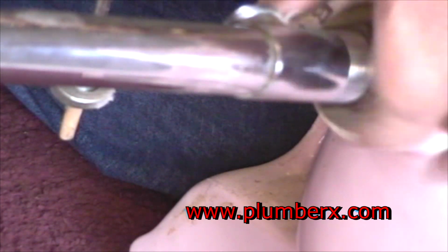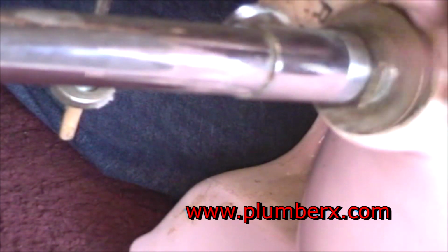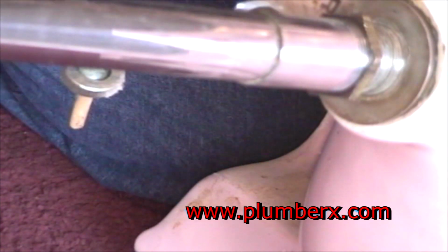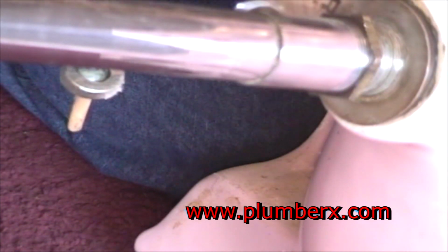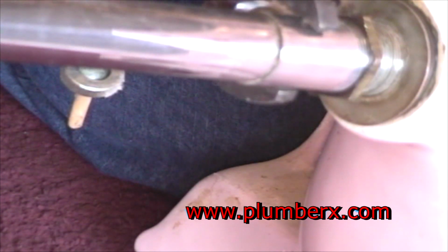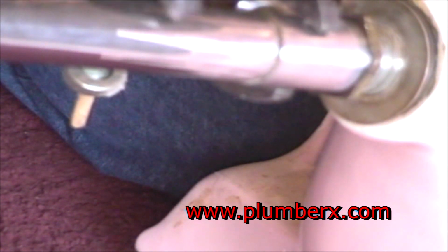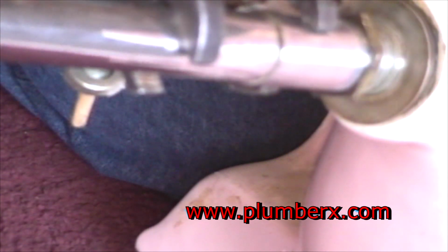And the reason is so that it will allow us a lot of free space to move the pop-up up into the sink. And then we can get to the other end from the other side of the sink with our channel lock pliers. And what I'm doing here now is just trying to loosen it up so that I can push it up into the sink.